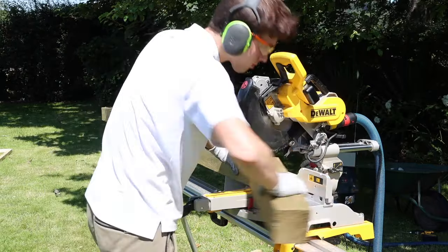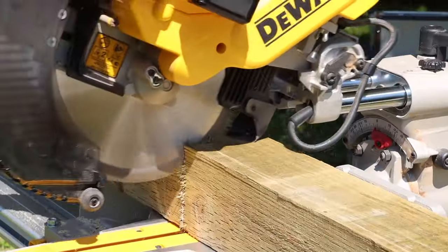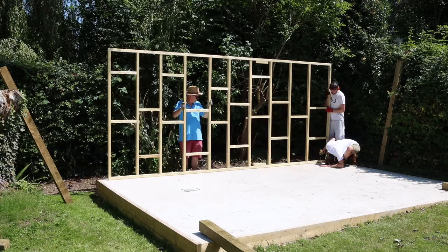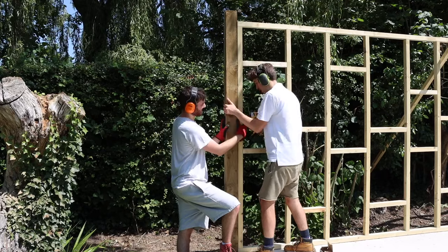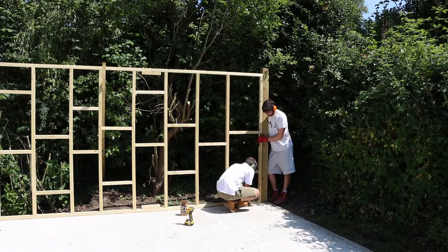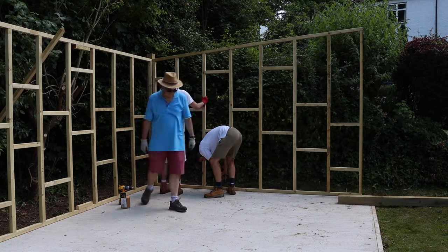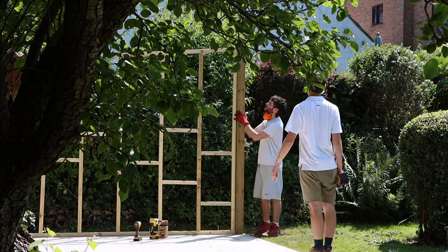I'm cutting the top of the fence posts and cutting them to the same angle as the sloped roof. I then collapsed everything down so I could drill into the concrete — with the walls up I couldn't reach all the pilot holes. So I removed the walls, cut the top of the fence posts off, and drilled into the concrete base, ready to lock the walls down. I screwed the wall into the concrete base first, then screwed it right into the fence post using really long, thick wood screws, which were very strong and locked everything in place. There was still a bit of wobble once all the walls were joined together, but that's because the plywood facing wasn't screwed on yet — once I screw the plywood facing to the walls, that will lock everything in place, make it very rigid, and stop any racking and twisting.